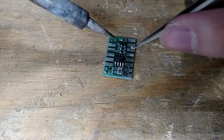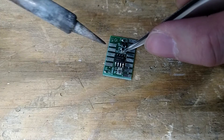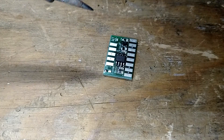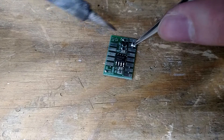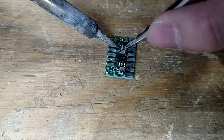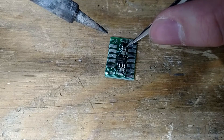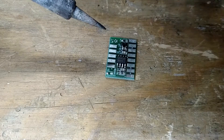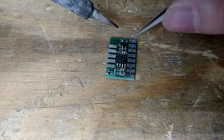C2 is supposed to be a 0.1 — it's just harder to get in there now. C3 is a 4.7-microfarad capacitor here, and that's 25 volts — all the caps on here are rated for 25 volts. And then another 0.1.